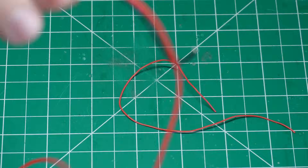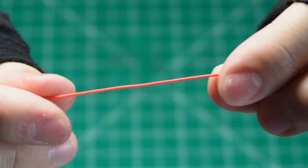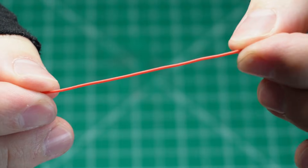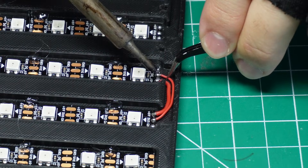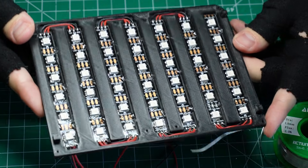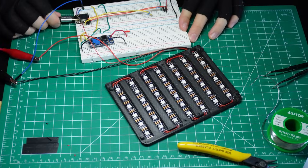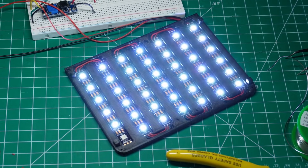To connect everything, I used two different types of wire — 26 gauge for the power rails and 30 gauge for the data lines. I like using thinner wires for data because it's easier to both manage and fit everything. I soldered every column one by one: power, ground and data. Satisfying, but definitely a patience test. After wiring everything up, I powered it on again to double check, and all the LEDs turned on just like before. We're off to a good start.